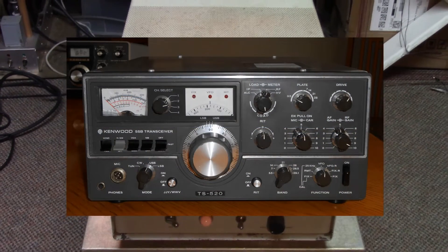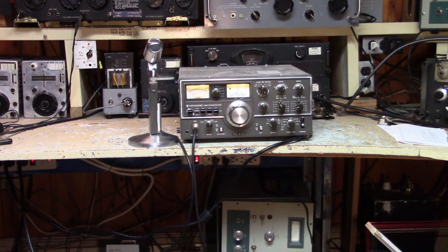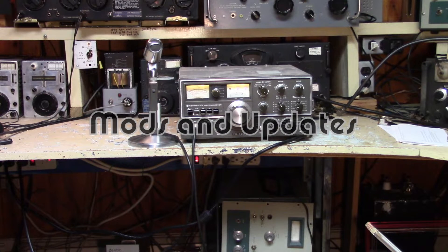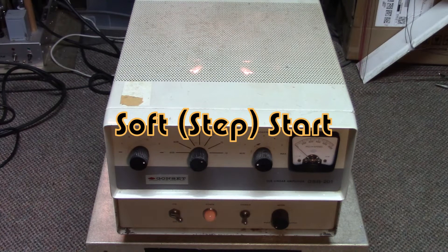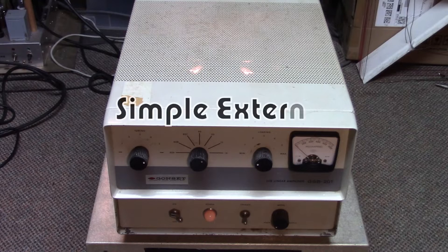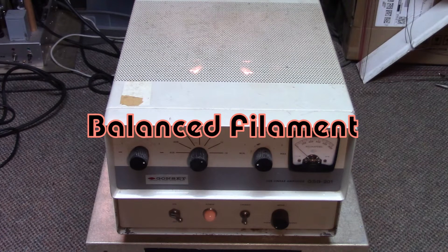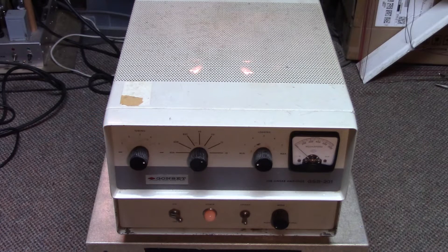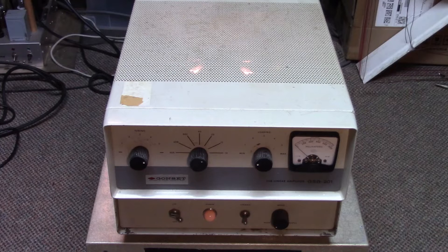I want to be able to use this with my newly acquired TS-520 and do some 40 and 15 meter work with it, so I've resurrected it. I've done some things inside the Gonset: I recapped the high voltage section and improved the biasing and switching, so now you just need a closure from the transceiver. I've improved the filament so there's less hum, especially in AM mode. It's working very well, and I've never had to change an 811A in this amplifier — I've used it off and on for probably 25 or 30 years.